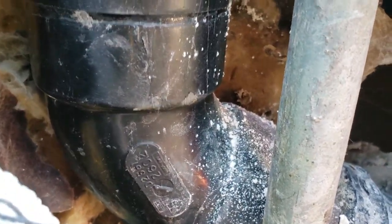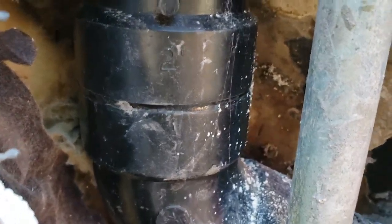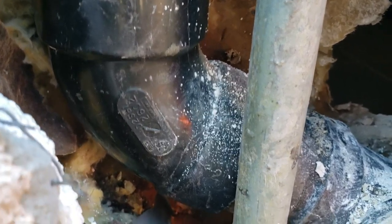We felt water at the top side of this test tee, and over here we could feel water at the hub of the 60-degree fitting — maybe a little water on the hub — but we couldn't feel anything any higher. We can't get our hand around the back side to feel anything touching the sheetrock.